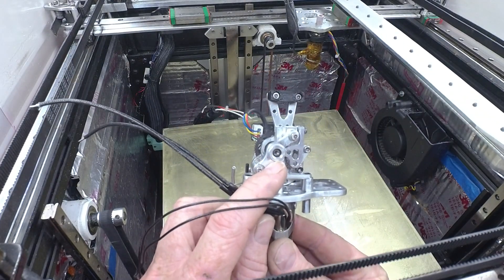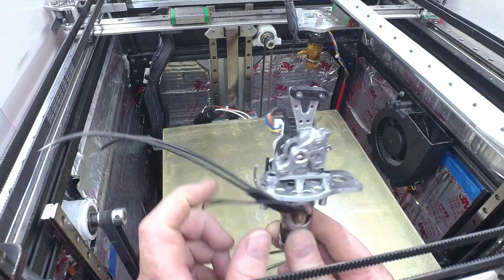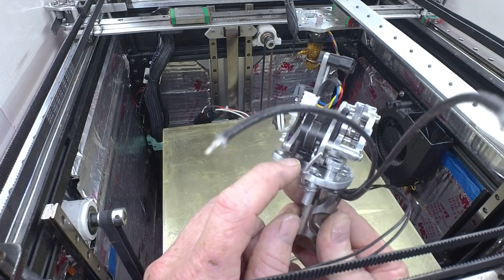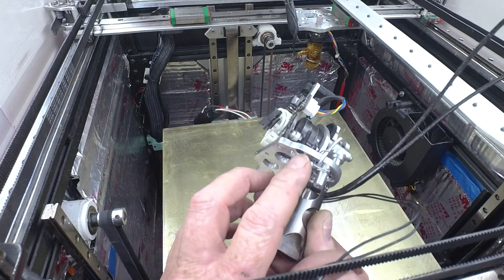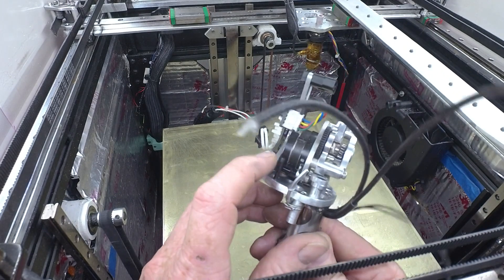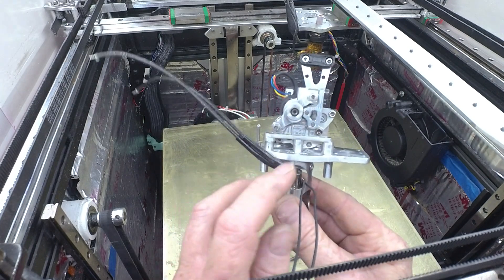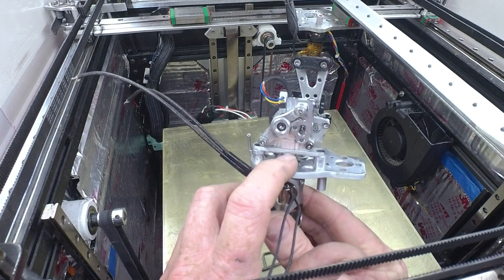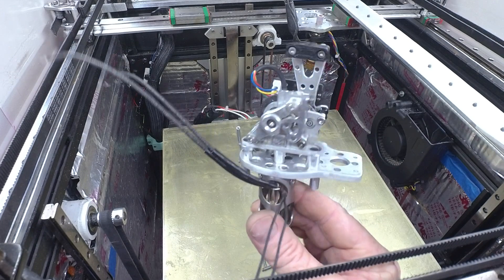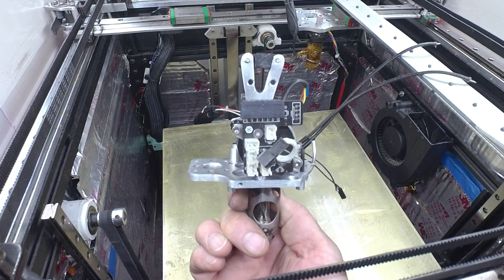I have a VZ extruder and I've removed the original back plate and made a new one to lower the motor down against this plate. I also have a backup bolt threaded into the bottom to trap this back end down. I've got my own custom Bowden guide from the extruder down and the Hartk tool board on the back.